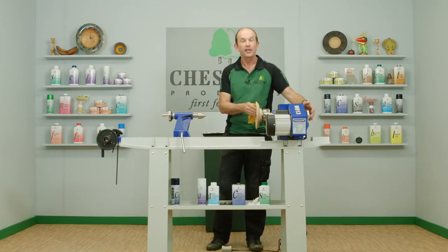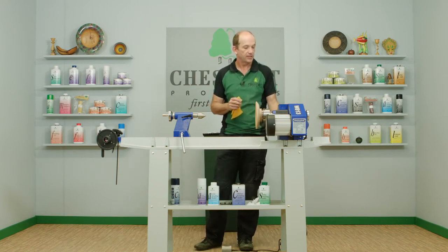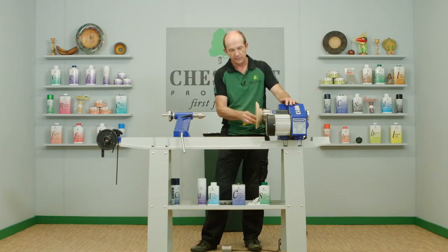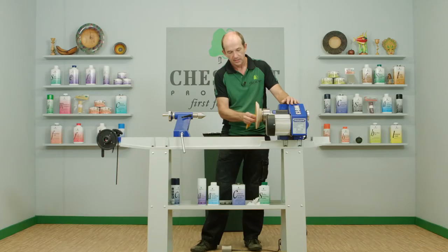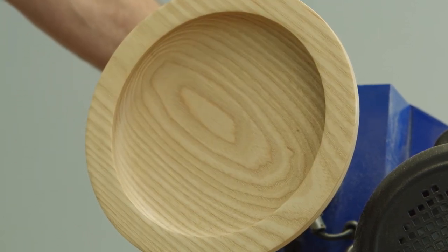So that's dry now and ready to cut back in preparation for finishing with probably a wax, friction polish, or French polish. We'll start the lathe up — nice gentle pressure, get into all the grooves, being careful not to remove the sharp edge. Just get the rim there. And that's done — it's nice and smooth, ready for the next coat.